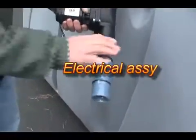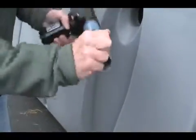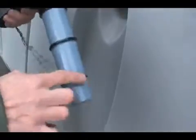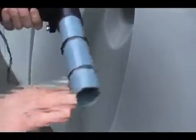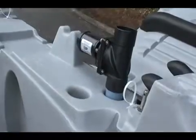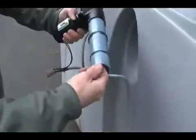When the valve is taken out of the box, there will be some packing plastic — remove the plastic. Take some of the existing lubrication and make sure to spread it around on the OD of the O-ring. Insert the up valve in the hole labeled 'up' with light pressure, then repeat the same for the down valve.